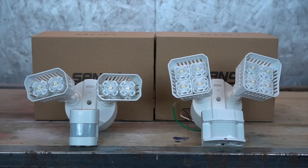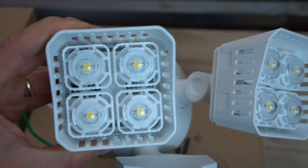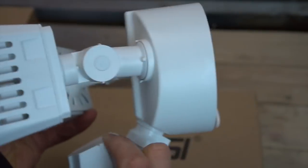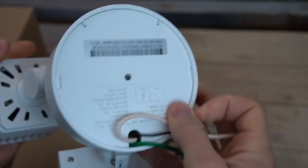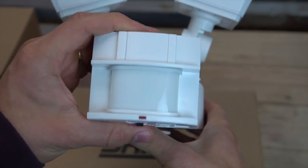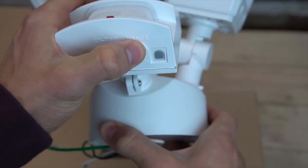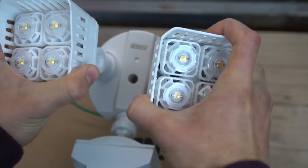Now, these are the two styles that I purchased on Amazon, and the reason why I purchased these units is because they are LED versions. LED versions are amazing when it comes to saving on electricity bills, and they have an extremely long lifespan — rated for 50,000 hours — so you're really not going to have to worry about replacing the bulbs every year or two. Other nice features include the fact that it's fully enclosed, so you don't have to worry about weather. There is a photo cell at the bottom which indicates whether or not there's light out, so it's not running during the daytime, which will save you money in the long run.